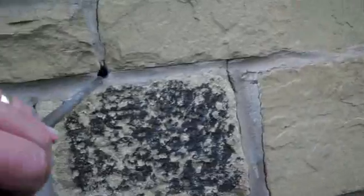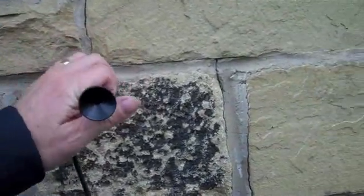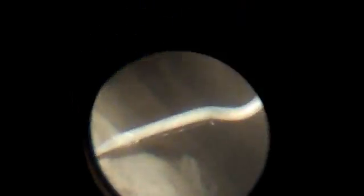Unfortunately stone is a natural material and what you'll find is that it varies in thickness when you get a delivery. What we commonly find — you can see the exposed tie out there. You can see what that is: the bit that you shouldn't be seeing — it should be embedded in the outer leaf.